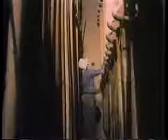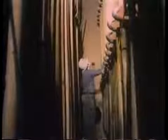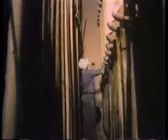Inspecting the superheater to find these problems is usually easier than inspecting the water walls. Access to the superheaters is generally accomplished by crawling through doors at either end of the tube bundles. Usually only a minimum amount of scaffolding is required for access. Now that doesn't mean that the superheaters don't pose problems.